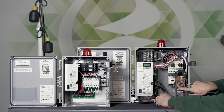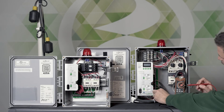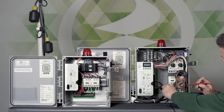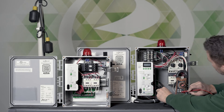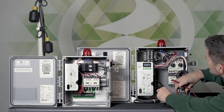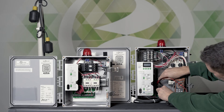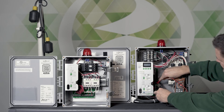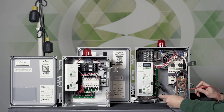I've got my meter set to AC voltage and I'm going to show you that the voltage across each of those inputs should be about 120 volts. Measuring terminals one and two of the lead, it reads 119.3 volts, so that's good. Each of those four inputs would have the same potential of 120 volts across it.